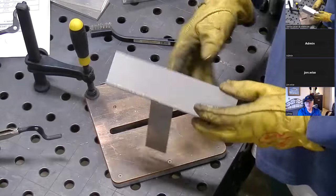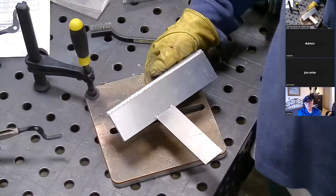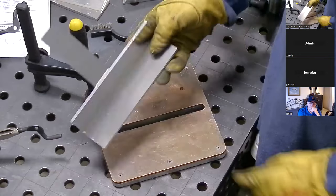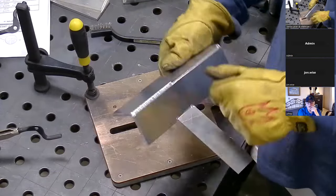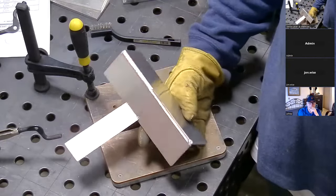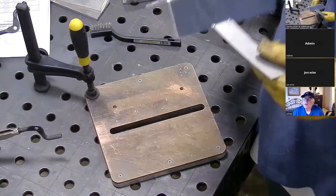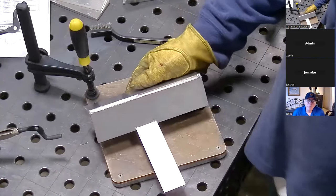Do you want to do it on the inside? Well, for us, welding it on the outside and not having to weld the whole inside and doing all the cleanup — we do 100% inside and out right now, which is a lot of time, a bunch of steps, a bunch of cleanup. The best bet would be to do it on the outside and then inspect the inside. If you have a little spot where it doesn't go through, touch it up, but definitely try to avoid double the work.